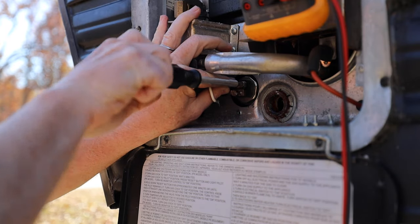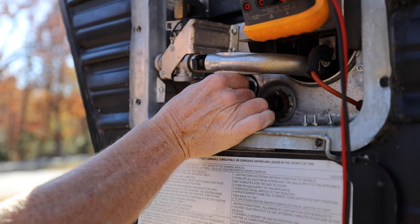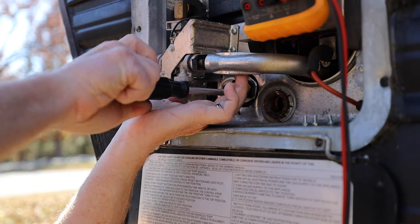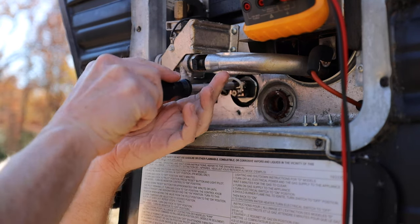Once you've checked the heating element and everything is good to go, put your wire leads back onto the screws, tighten everything down, and put it all back the way it was. That will tell you whether or not your heating element is any good. This method for checking your water heater element is about the same for any kind of water heater, whether it's at home or in your RV. The most important thing is to make sure everything is turned off, and if you don't feel capable of doing it, have a technician come do it for you.